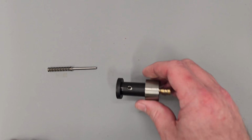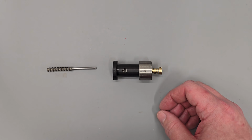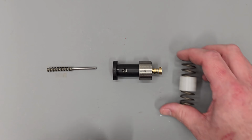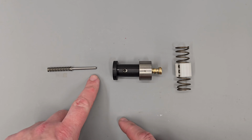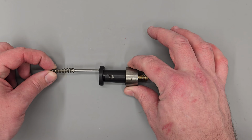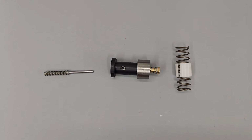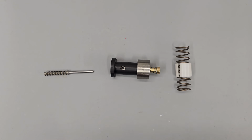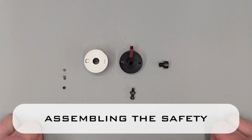A slingshot hammer is very beneficial in terms of efficiency, as the rifle can run a relatively heavy hammer spring, a relatively light hammer, and we don't have to worry about any valve preload. Valve preload in this case would be if the hammer was always trying to force the valve open. Having a slingshot hammer reduces hammer bounce, and overall it just allows the rifle to get a load more shots with no real downsides. With that done, the next thing we're going to do is rebuild the safety assembly.